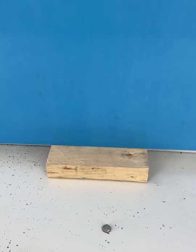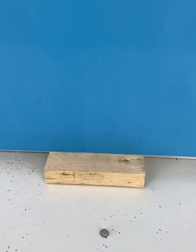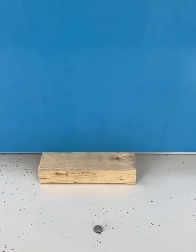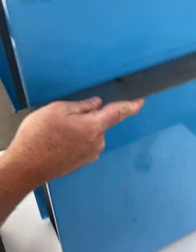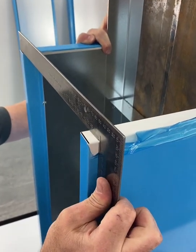Make sure you're leveled perfectly and then place the screw in the top right corner. Use one block in the center on the opposite side or any other shim you have. Shim it up the same as the opposite, how you set the first one. One block in the center might be easier for squaring off the panel as seen in the next step. You need to make sure the panel is square in this direction, top and bottom, along with the same height.